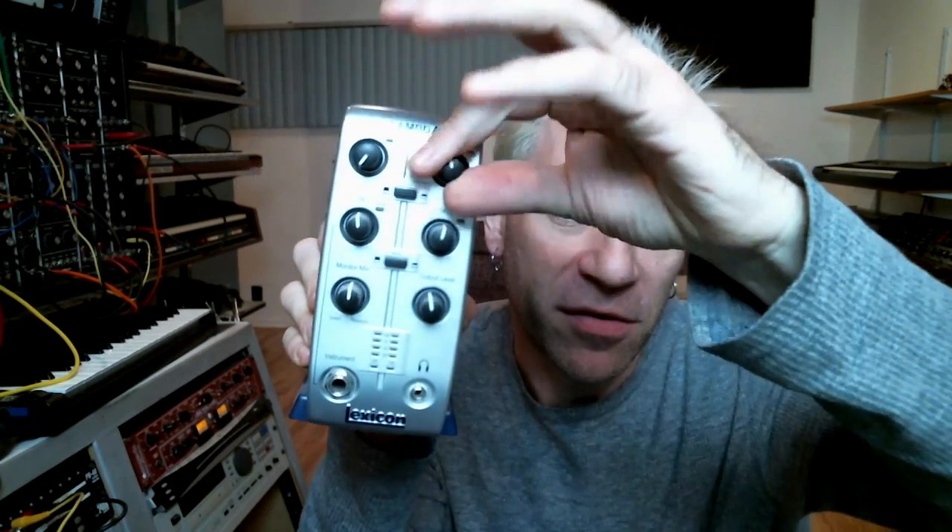Most modern audio interfaces include two or more channels of microphone preamps, like this Lexicon Lambda — you can see the input level knobs for the mic pres and the XLR inputs on the back, along with 48-volt phantom power for condenser microphones. You can use the internal ones, which usually sound pretty good, or get an external mic pre. There are budget external mic pres boasting tubes, but you usually don't get much audio improvement from a cheap one. The warm tube sound is actually attributable to transformers, and good transformers aren't cheap. Great bargains in the $500-and-up range come from companies like Golden Age, Warm Audio, and Focusrite.